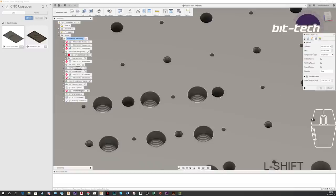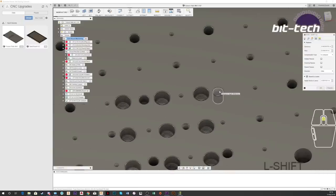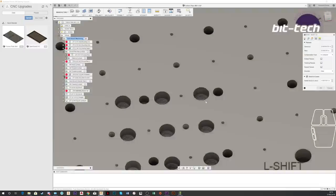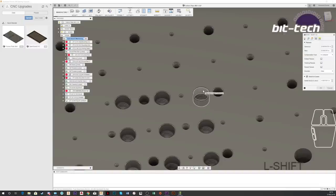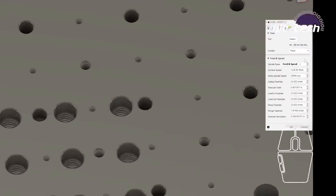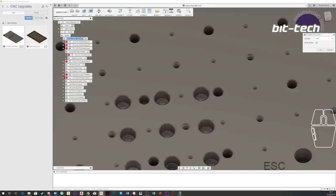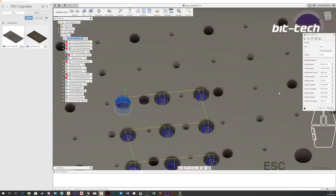That's actually minus 0.03mm. Now that's the same clearance that I've used for the other dowel pin holes, and it worked really well for that. And after doing a little bit of experimenting with the half inch ones, it also works fine for that. So I'm sticking with that known quantity, and that should provide a really nice press fit, but isn't going to be too firm. The actual speeds, I'm going to be going with, oh, I can't work with any of this. Let's just switch this back to metric. Okay, we're back in the metric system now.